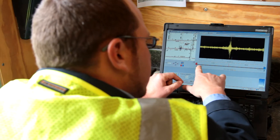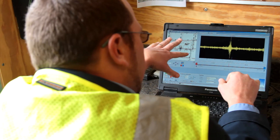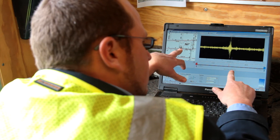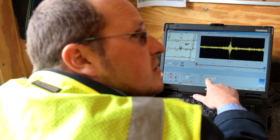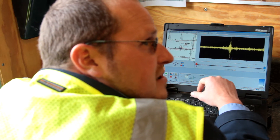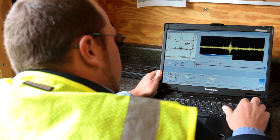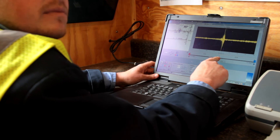What you do is you put the address where this unit is here, address here — this is a map of our water distribution system. You put your two sensors on here, the distance you wheeled off right there, the type of material the pipe is — like ductile iron, cast iron, PVC, or whatever — and the dimensions, like a six-inch diameter or whatever. Then you come over here and start recording. It marks off the distance exactly so you know exactly where the leak is.